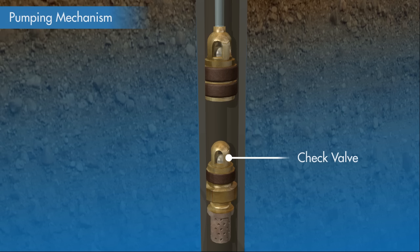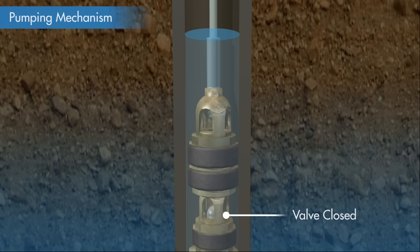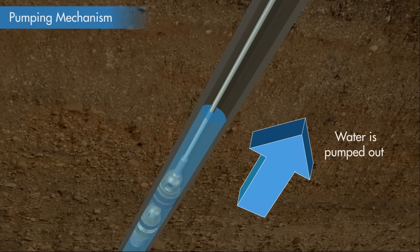There is a similar check valve at the bottom of the cylinder that is fitted to a strainer below the water level in the ground. On a downstroke, water is held in the cylinder by a check valve and the plunger descends to the bottom while the water passes through the plunger valve. With each upstroke of the pump, the plunger forces a cylinder full of water into the drop pipe and out to the discharge tank, hence pumping the water out.